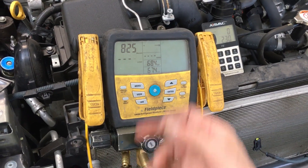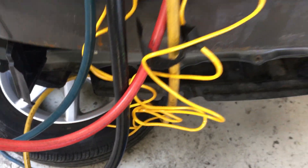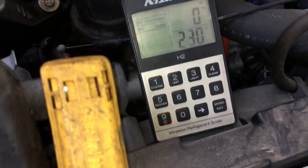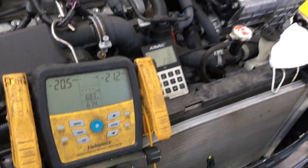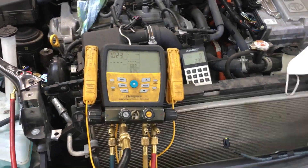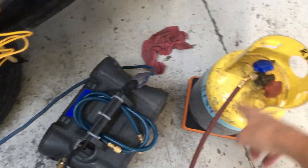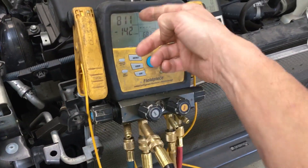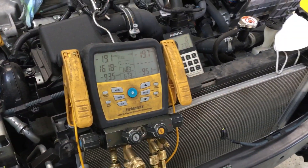We're into micron level now — the system is very empty at 230 grams and we're 9 minutes and 50 seconds in. I'm going to close off so I can do a bleed-down test, let it stabilize out, and see if there's any more refrigerant still in there.